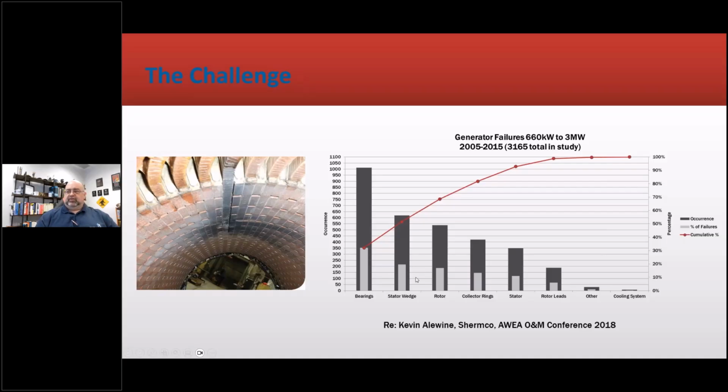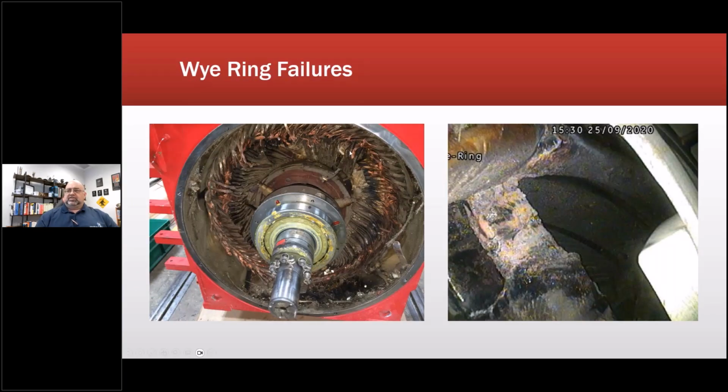We'll talk about that at one point. Rotors, that's the big one. That's the one we've just recently solved for the industry. That's what I'm presenting on at PES at the end of July, Power Engineering Society. Wiring failures are the rotor ones. This is the catastrophic end of it when it just lets go and basically the winding takes out the stator. This is a fractured wiring. So when you hear me talk about it, that means that's the connection for the rotor winding. These are wound rotor machines.